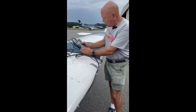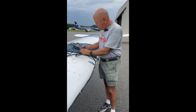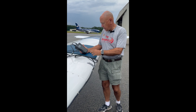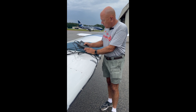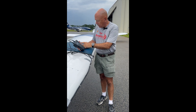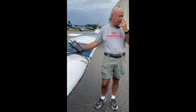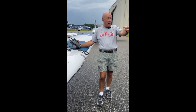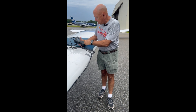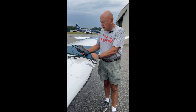So the next thing is just hit next. It wants to know the number of blades — three. We're going to tell it three blades, then hit next, and set the direction of rotation to counterclockwise — CCW. Then it asks where the optical tach is relative to number one blade: it's right there in line at 12 o'clock, so we mark that in line. The accelerometer is also at zero degrees. How many locations for weights? That's 12 — we numbered the holes 12, remember — and that's important because it's going to decide where we can put those weights. So we enter 12 and hit next. Three blades, direction of rotation confirmed — we accept it. Now it says prepare for the run-up.